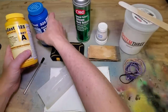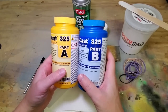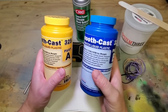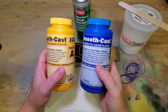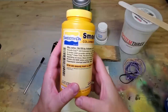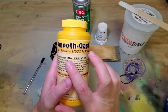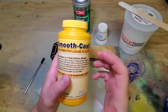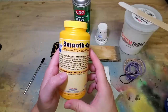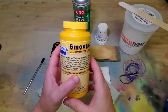The main component of a resin lure is of course the resin, and currently I am using Smooth-On Smooth Cast 325, which is a two-part resin. I find that it makes a really smooth copy of my lure, so I've been really happy with it. As far as mixing instructions go, it has a one-to-one by volume, but I always weigh it — 115 parts A to 100 parts B. This does not have an incredibly long shelf life, so you don't want to buy it and just leave it on the shelf forever.